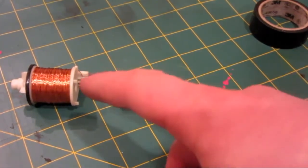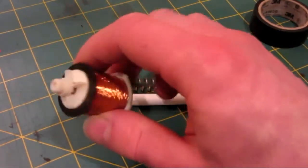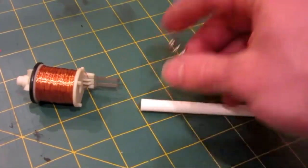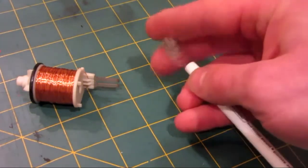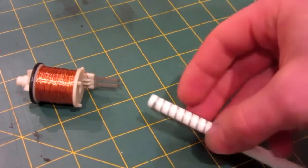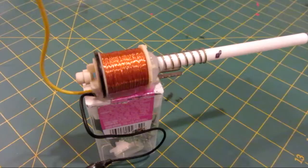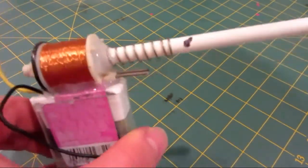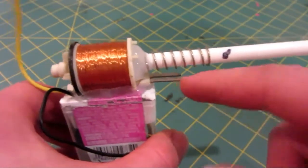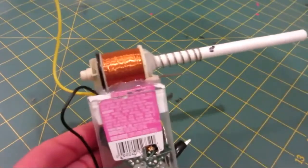Before we get to the wiring, I'm going to do the barrel assembly. This is our coil. It has a blockage in the back, which is perfect so our ammunition doesn't just roll backwards. The barrel is going to be made out of this pen tube. I'm going to use this spring over top of the end of the pen tube to widen it up a little and give it that sci-fi look. Then using some hot glue, I'm simply going to attach it to the center of the coil. I've also attached the coil on top of the tic-tac container with the prongs facing the opposite way of the wires, so we have lots of room for wiring.